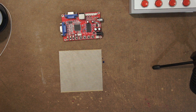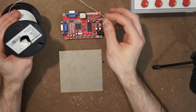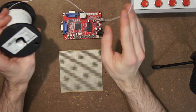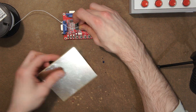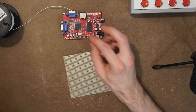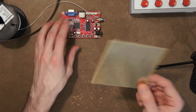The first and most challenging part of this project is to solder to these tiny 0.8mm pitch SMD pins. To make this as easy as possible, I recommend using leaded solder, a flux pen, and thin solid core wire — I personally use 28 gauge solid core wire. Some people like to use enamel coated copper wire for this sort of work, but I find this size works fine and I can rely on the insulation a little more. What I do is use this thin solid core wire to solder to the IC pins, then solder these wires to a section of Veroboard that I can secure to the converter itself. That way the fragile connections won't move around and break off. I then use some standard ribbon cable to go from this Veroboard to the connections themselves. This approach has saved me a lot of headaches in the past and is definitely worth the extra steps.